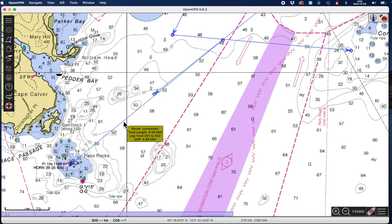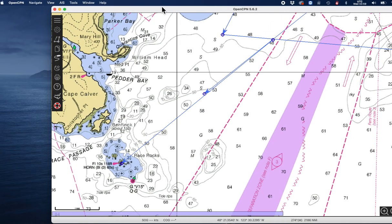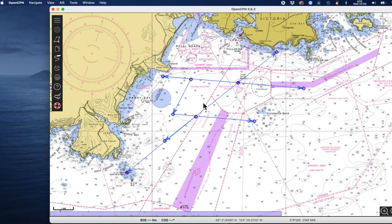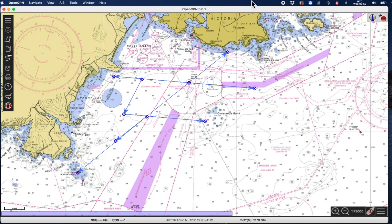So that's the answer I get: 4.5 miles at 209. The answer in the book is 4.6 at 210, so I'm a little bit off. But that's the procedure — that's the way to solve it. Maybe if I had been a little more careful I could have gotten back to that one degree, but that's how you do a running fix on an electronic charting program.